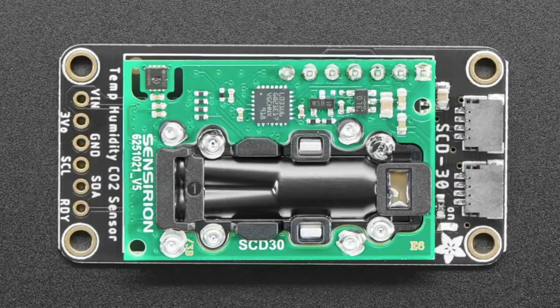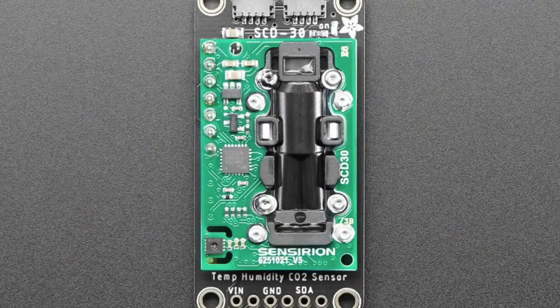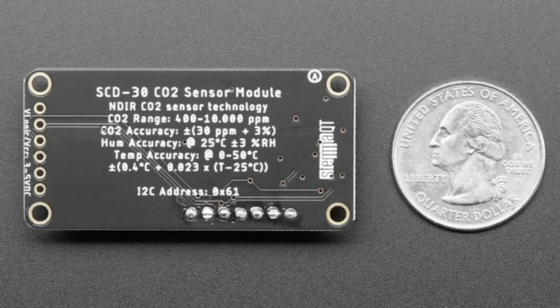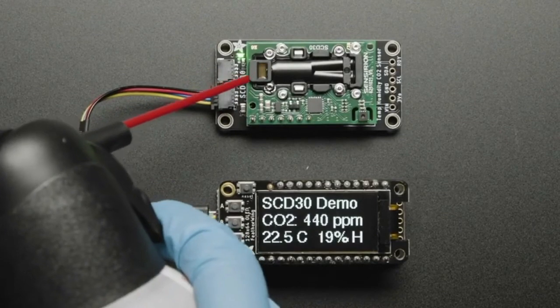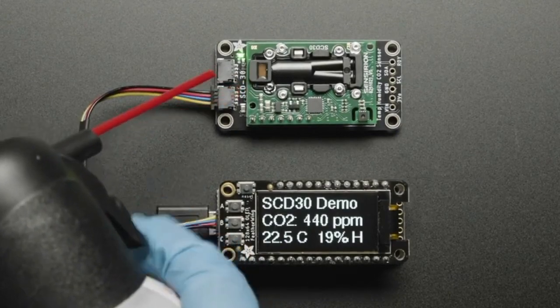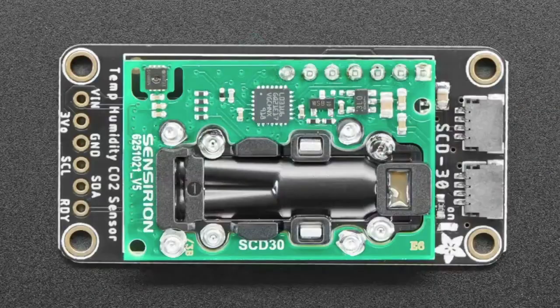The sensor module is this kind of chunky green thing in the middle. There's actually a little microcontroller and also an SHT31 humidity and temperature sensor, so you get CO2 plus temperature plus humidity all over I2C. The data pops out over one I2C port. We have code in Arduino, CircuitPython, and Python. It's very easy to use — basically every two seconds you get a new piece of data. You can change how often data is emitted, from two seconds up to an hour.